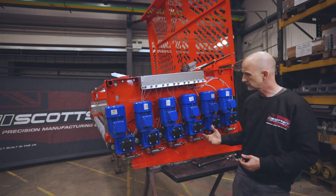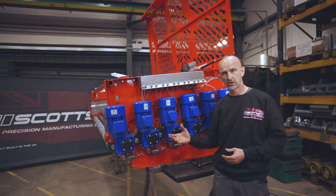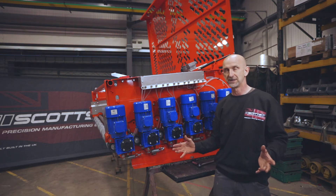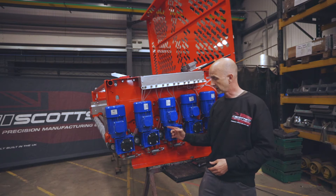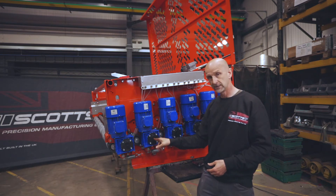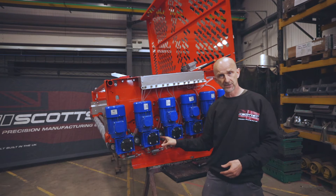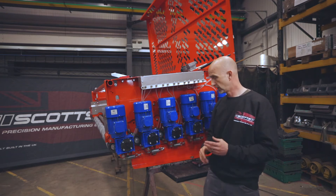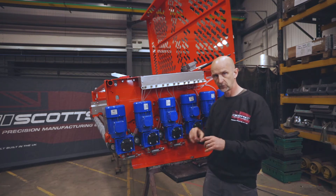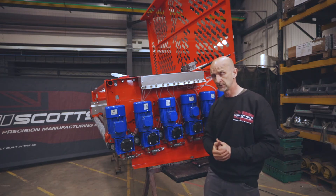We offer other types as well. We generally go to European motors — one of the higher grade ones is the SEW brand. They offer a range of upgrades and they're very good. The SEW drive offers a torque lock system. Rather than having a hollow shaft gearbox straight over an 8mm key on a 25mm shaft, we go to a 30mm shaft that's keyless. SEW offers a torque lock system where we have two taper locks on either side of the gearbox, and we're just able to slide that on a plain shaft.